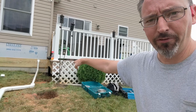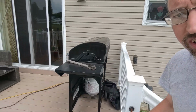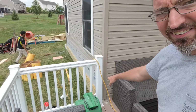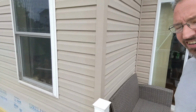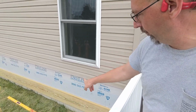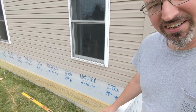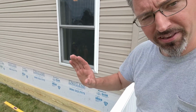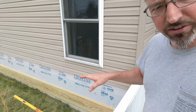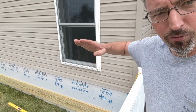It's going to be the correct height to match this deck over here, and we can see that we're down that 8-inch step, and so that puts our ledge board down so it's centered in that sill plate. And so we've got to get some blocking in there in order to have screws to tag this top part in so we make sure we've got something holding there. Had to rabbit out the back of the board where the foundation is, because the foundation sticks out proud of the sheathing, and Norm doesn't want to just run screws in there because it's going to take that board and pull it cattywampus.